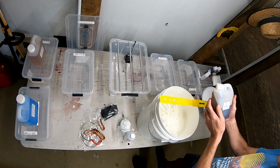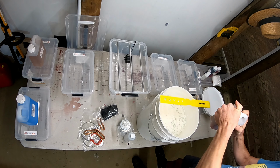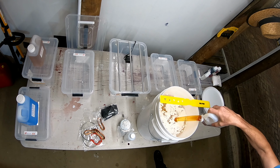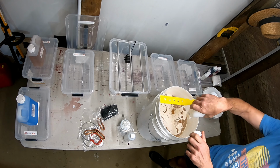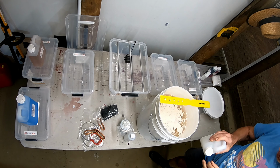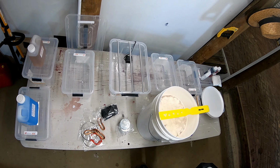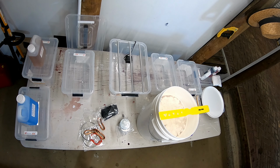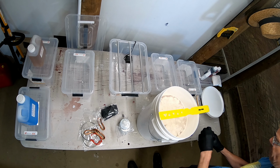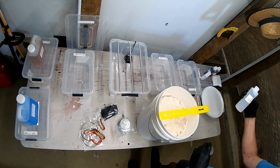Now we've got our zinc additive. This has all got to go in the 20 litres. Well, there we go. Now basically once everything is in there, it's got to add up to 20 litres. So you don't put 20 litres of water in and then put everything in. The final quantity's got to be 20 litres. Next one to go into the electrolyte bath is the zinc brightener. So 1 ml per litre of bath size, so that'll be 20 ml.